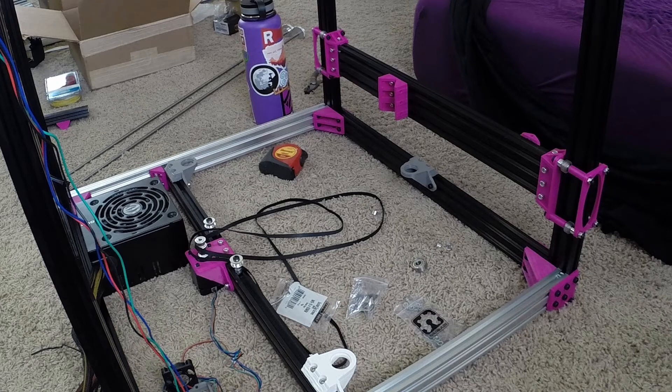In the upper right-hand corner you can see the same gantry with the wheels offset. Since I don't have the footage, let me explain what's happening here. You can see a layout of how the Z bed attaches to the frame. The big box component is a power supply — an ATX PSU — because the motors require quite a lot of current, and I'm also powering a Raspberry Pi and other things. There is one single motor on the Z axis, which will be synchronized between all three of the lead screws that run the full height of the printer.